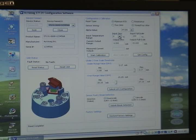Today I'm going to change that calibration to a minus 50°C to a plus 50°C calibration. So all I do is click on the input zero and I have three choices. I'm going to select minus 50°C as my zero percent value and type in plus 50°C as my full scale value. It's that easy.